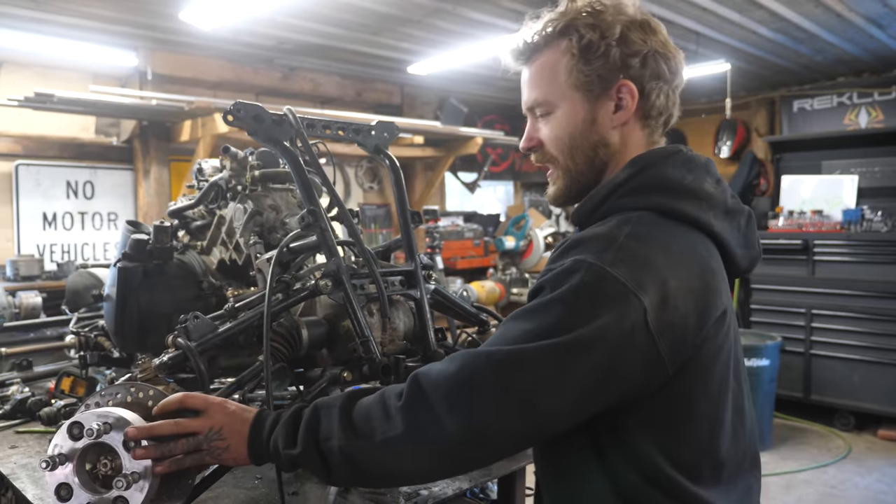To make my removable section of frame I need three unboltable locations — here, here, and down here where this bar ties in because that has to attach and be removable. What I've made here is one half of a one-inch tubing bolt-together coupling. This would be more accurate if I had a mill, but I made it by hand with the grinder. The end I turned down on the lathe so it fits nice and snug into the tube — this one is halfway done, got the tube section done, now I just have to cut it to fit.